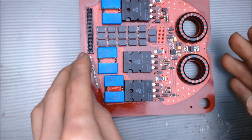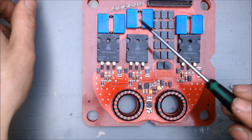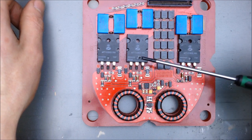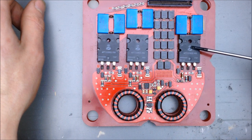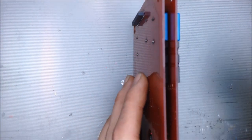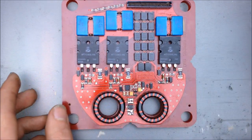So now this whole unit is a single switch. Let's take a look at a single board's rated capability. These are 1600-volt capacitors, and each one of these MOSFETs is rated for 1200 volts at 20 amps, which means together they're 60 amps in total with 1200 volts. These two boards in series double the voltage, which means now it's 2400 volts at 60 amps — which is insane.